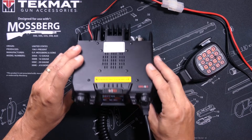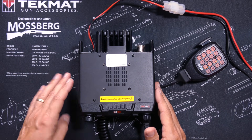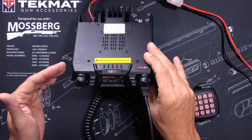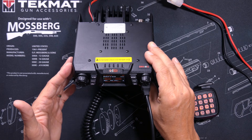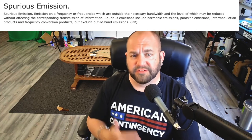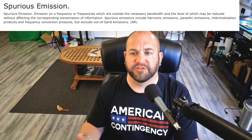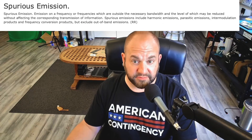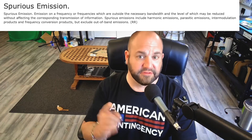Because I am not a licensed ham radio operator, some people have decreed that I should not be permitted to talk about such technical things on YouTube. So to explain what spurious RF emissions are, I asked a friend of mine who is a ham radio operator to explain it in under one minute. Hi, my name is Mike, amateur radio extra class call sign K8MRD. I've taken not one but three tests so I feel I'm qualified to answer this question. A spurious emission is defined as an emission on a frequency or frequencies which are outside the necessary bandwidth and the level of which may be reduced without affecting the corresponding transmission of information. Spurious emissions include harmonic emissions, parasitic emissions, intermodulation products, and frequency conversion products, but exclude out-of-band emissions.